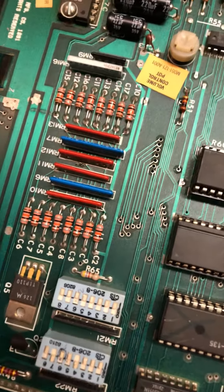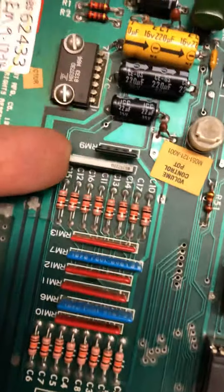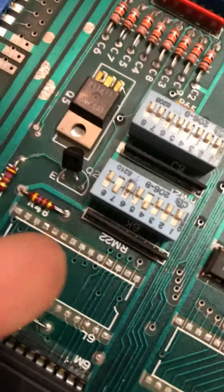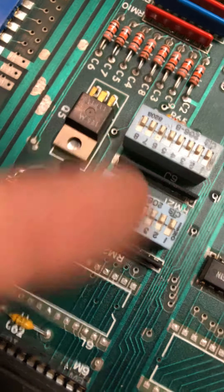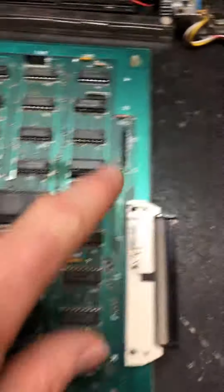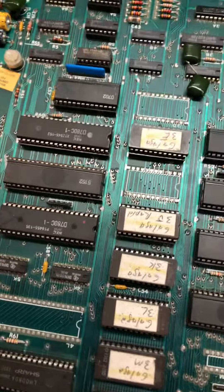Your Galaga board is back up and running. I ended up replacing the unencapsulated resistor packs like we talked about — the red ones are the new ones. That one there, and those two are also new. There are a few more on this board: that one, that one, that one. The rest had already been changed, or they were already encapsulated at the factory. These blue ones here were factory installs.